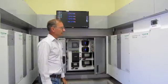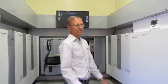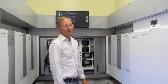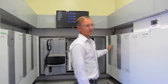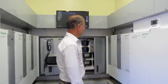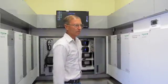The really cool thing about the way Xantrex has done this is that in a solar system you don't want to have everything on standby all the time. These are all transformer-based inverters, so you've got a big coil of copper in there that has to be lit up all the time, and that takes energy. So what we decided to do was use this product where this unit is set up as the master in this cluster and the remaining ones are set up as slaves. These are all asleep until a sufficient load comes on and they need to wake up. It's something like 30 watts of energy just to keep this on standby, and then it wakes the others up as needed.